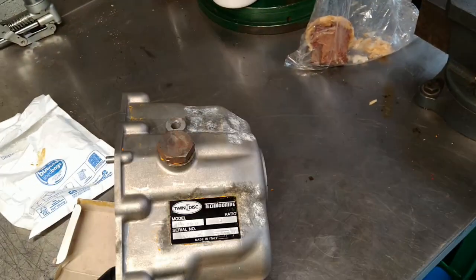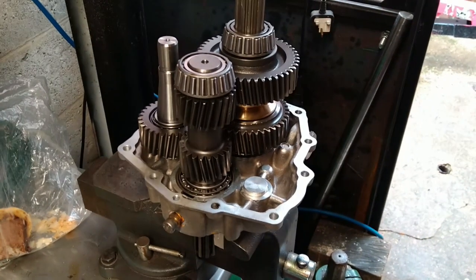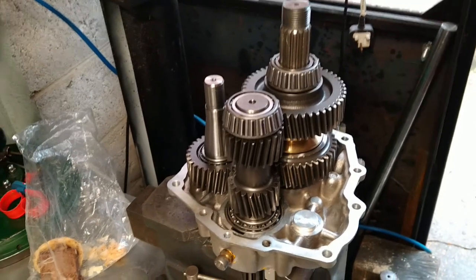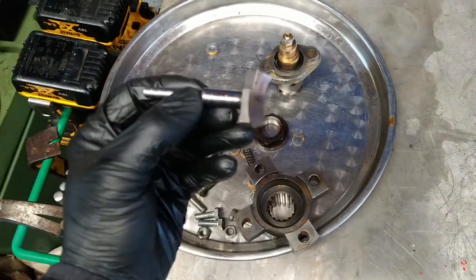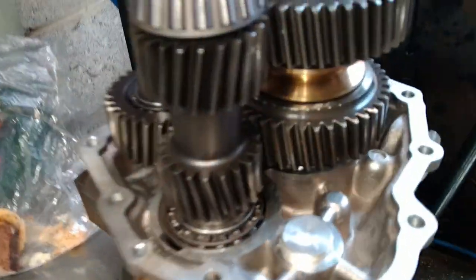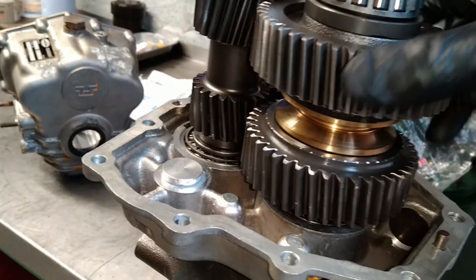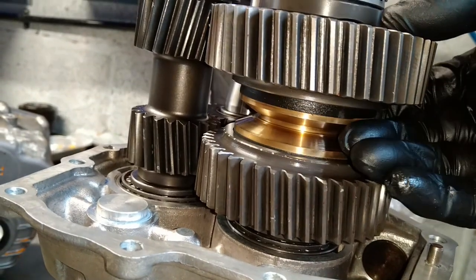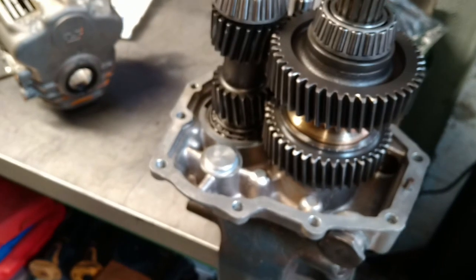There's a little bit of yellow paint left all over it, but typically speaking they come off a lot of engines. They're very similar to PRM's boxes — they're mechanical boxes at 120/125. They have the same selection mechanism, the floating mechanism in there which fits into the clutch, and they've got exactly the same clutch, which is really interesting. However, PRM have made their new clutches a lot better than the old style. This has got the 120-style clutch, so there's a nice shiny clutch in there as you can see.